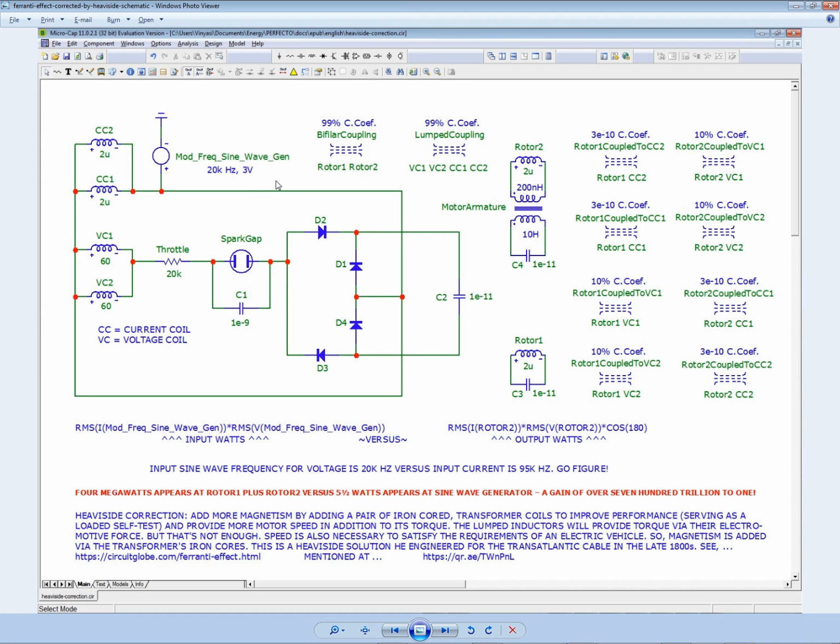Okay. So you see the wave? The blue is the voltage, so it's dominating the current. But we don't get to see yet because we have to zoom in. So when we zoom in, we're going to lose. So remember now which way the wave is in this window of view. We've got the peaks over to the left side of the graph and the troughs over to the right. It's going to flip when we look at the red current. But we got to zoom in and remember the voltage, because we're not going to see the voltage anymore.